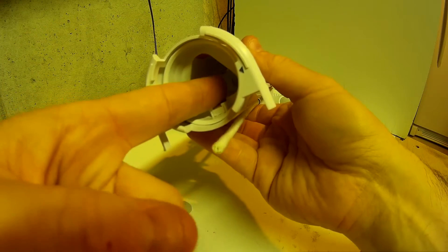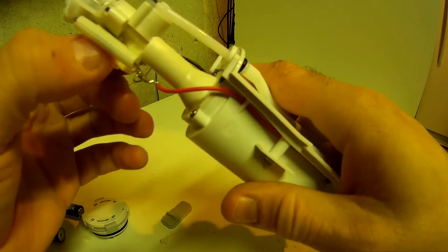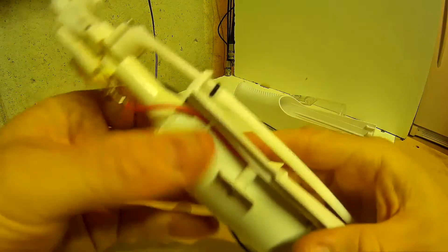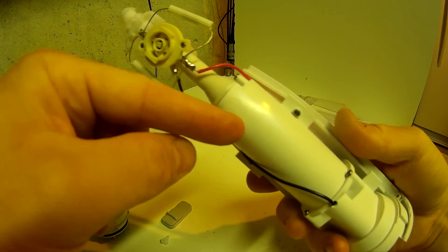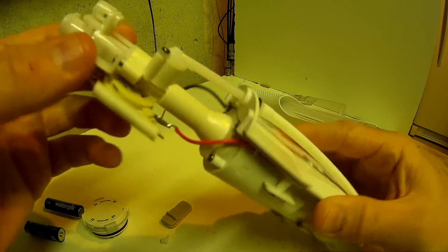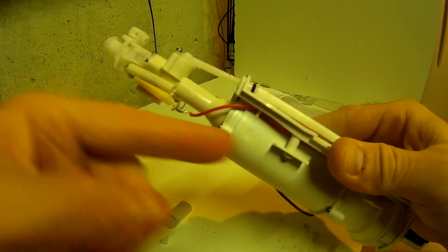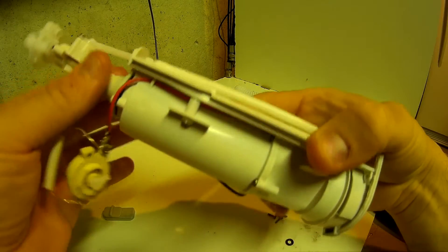It's simply 4.5 volts — because 1.5 times 3 — then through different resistors to power the motor. The motor should be in this chamber here. I can see the straw going up through here; there's a small pump and it appears there's a motor inside that essentially circulates a gear or shaft that spins around the pump. Water comes up the straw and shoots out the end.